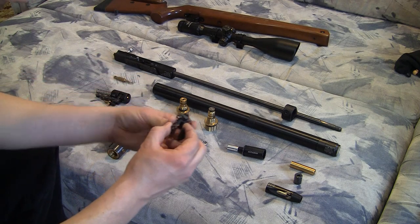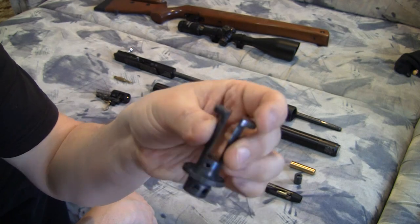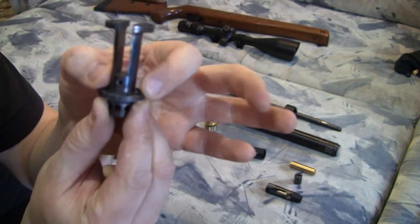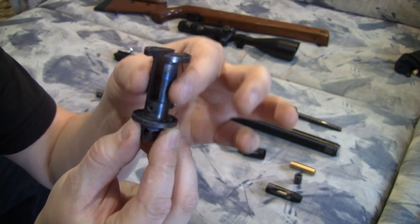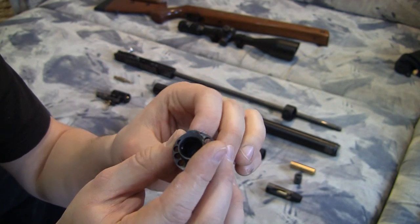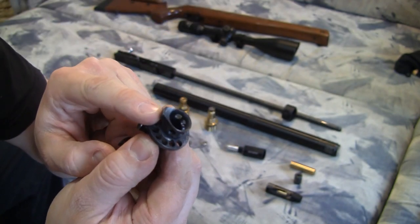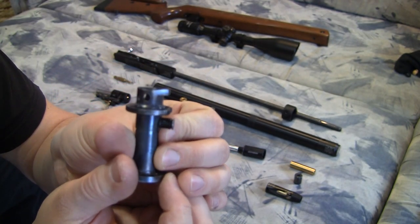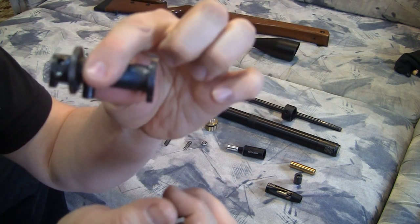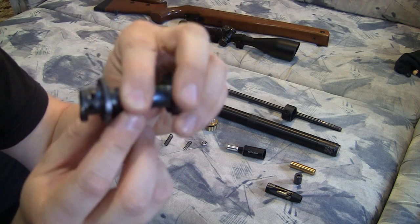That is why I drilled a lot of holes, hopefully you can see this, everywhere I actually could, and I also made it a little thinner. So I took some material off here, and I also took some off this side, and I took out all of this except for the part that is actually used for the trigger part that holds the hammer back, so the sear that is trapping the hammer when you cock the rifle.